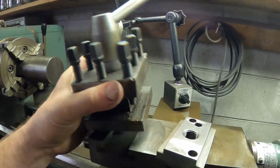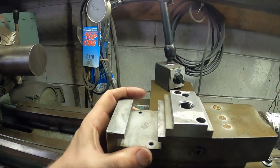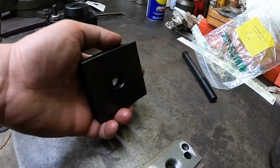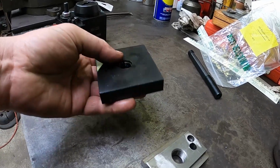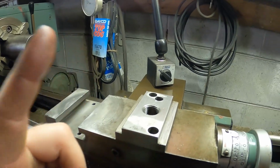I took this apart. I took the T-nut out. That's this thing. And now I want to mount the new quick change tool post here. It has a block that's way bigger than all of this that I'm supposed to machine into this shape. But I had an idea.